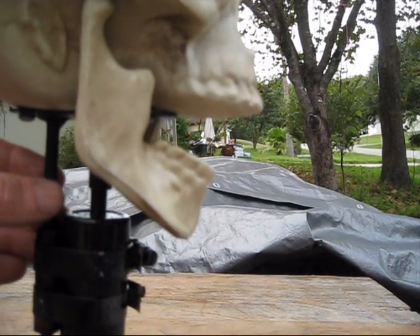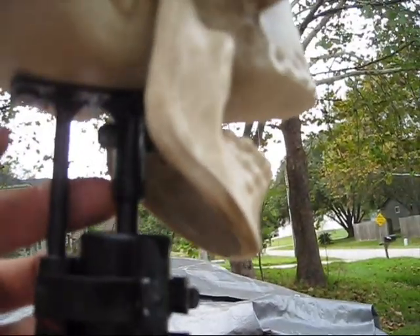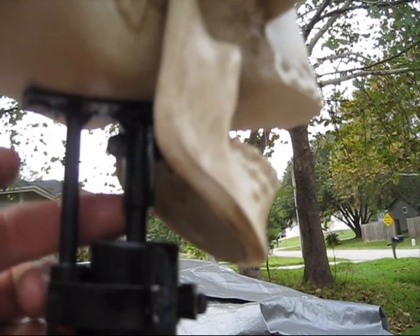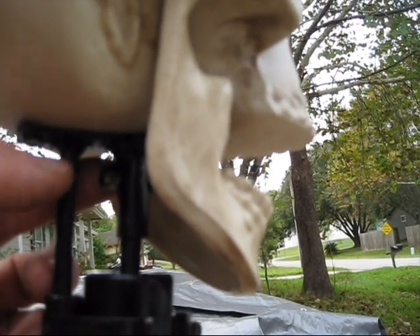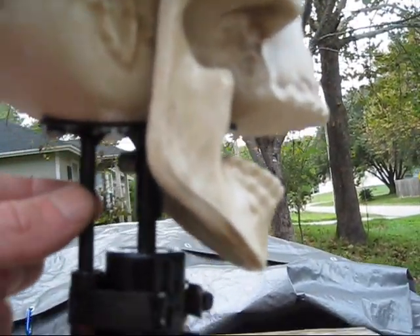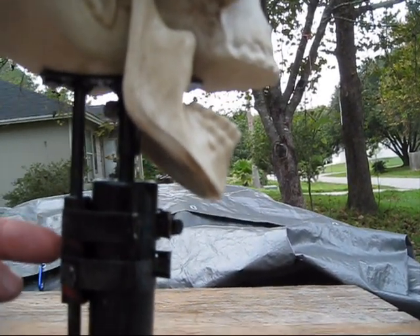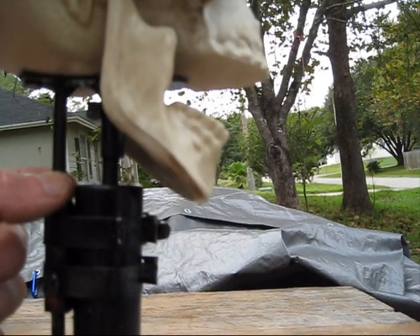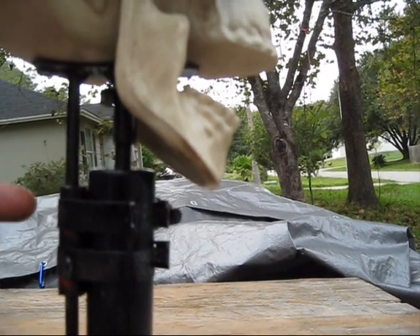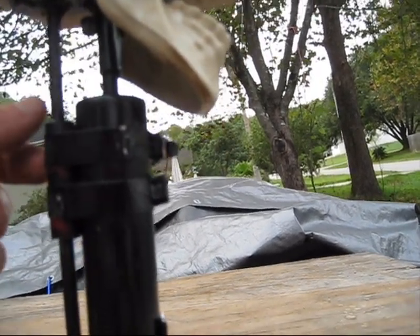So I created this rod here. For the skull mount, it's just a little tube that sits over top of the end of the rod, then a bolt goes through with the hole at the end of the rod, a plate that is screwed into the bottom of the skull, and the rod is welded to it. The rod runs the full length of the cylinder and goes through this little bit of tube, which is hose clamped onto the cylinder. It does move back and forth a little during actuation, but this limits movement to an acceptable amount.